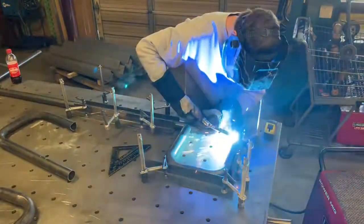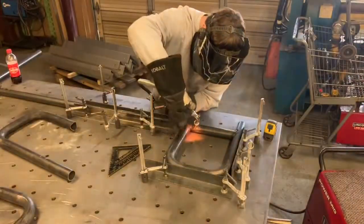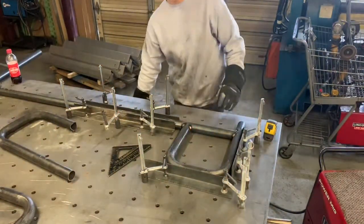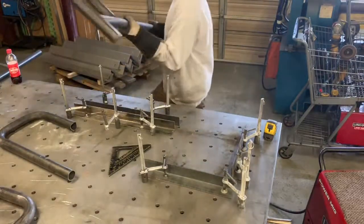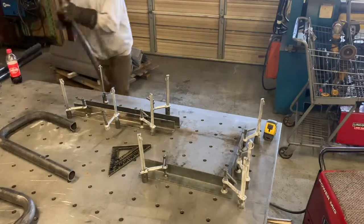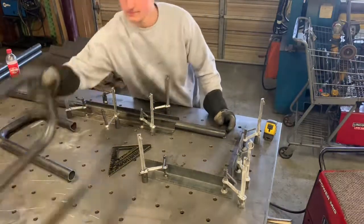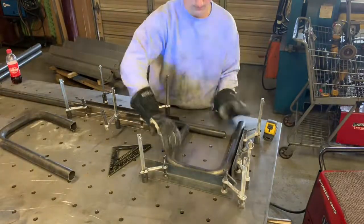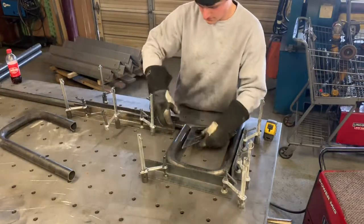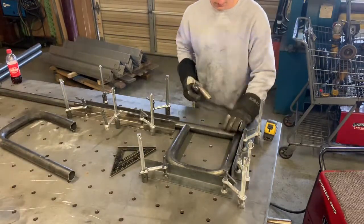You want to keep your beads nice and smooth - we are running downhills, which makes it a little easier to keep a smooth bead. You'll see in a minute we grind all of that off - we grind everything completely smooth, absolutely no welds left on these. Like I said, you do everything at the same time; it's more of a production style way to do it but it makes things a lot more efficient. You get things done a lot quicker doing it in stages instead of jumping back and forth from bending to coping to cutting to grinding to tacking.